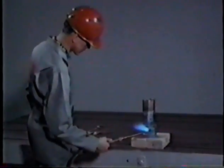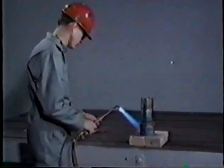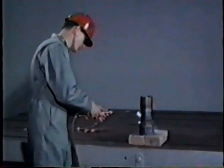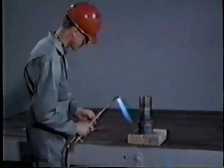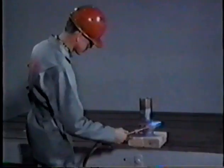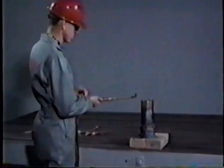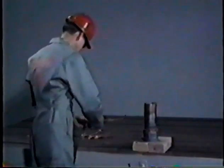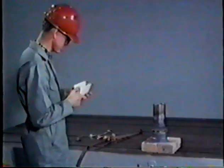After brazing a pipe that's 2 inches or larger, slow down the cooling by applying light heat to the pipe a few inches from the fitting so the fitting will contract faster than the pipe. This will prevent the pulling away of the pipe from the fitting during cooling and contraction. Identify your work and fill out the control forms for use in maintaining joint control records.